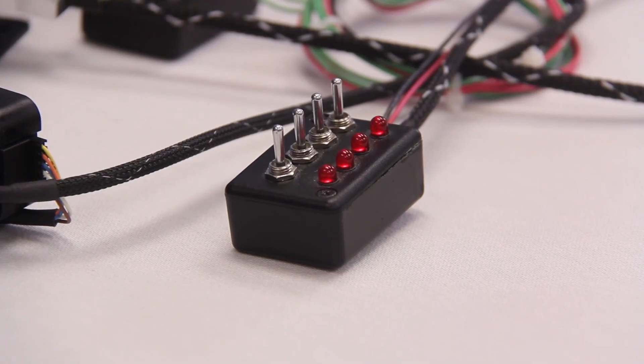So we have moved halfway down our rail after initially stalling, as indicated by our active LEDs. The second encoder feature is called position verification, and it will continually monitor the position of the motor and ensure it stays where it was designated to go from the previous move command.